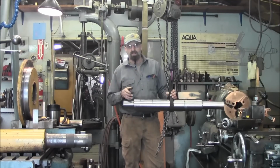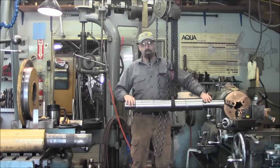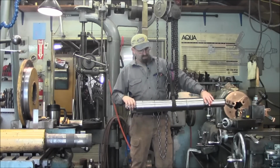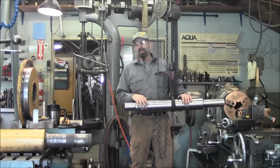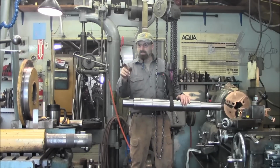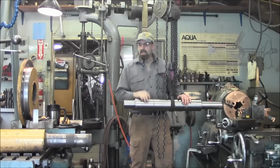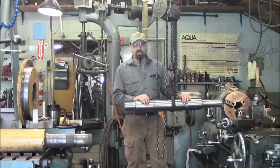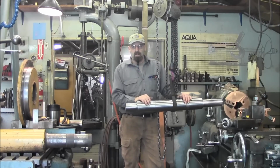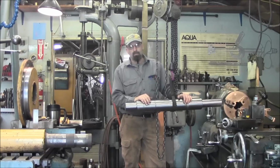They're within 1/4 inch or so, and length and radius and all of that kind of stuff, those are important things. We left enough material on there. This diameter right here is a 1/4 inch or a little bit better than the actual diameter, but we are going to have a little bit larger diameter because the bore in that flange is considerably larger by almost exactly 100 thousandths. It was a larger bore than that shaft. I have to think that was not planned.